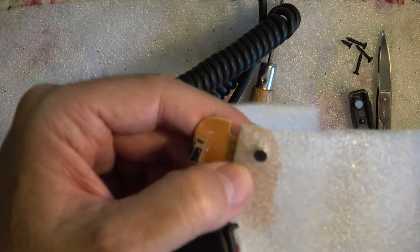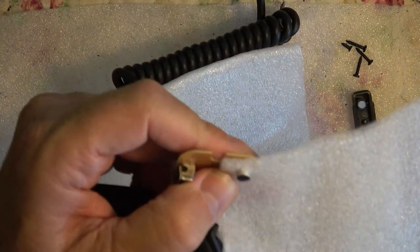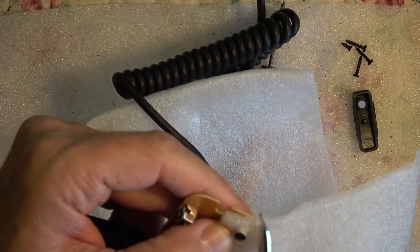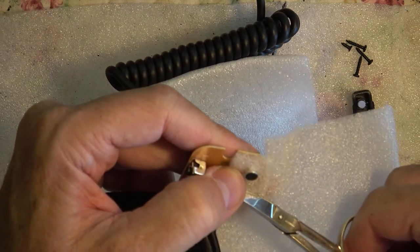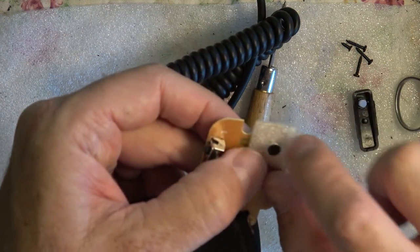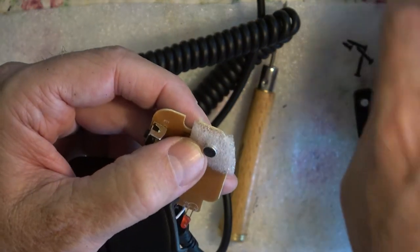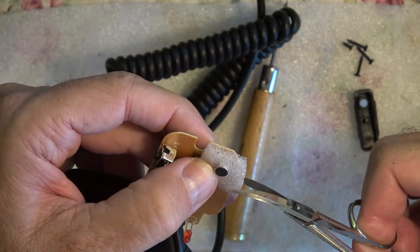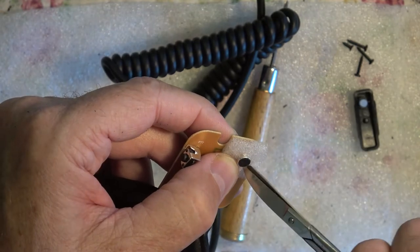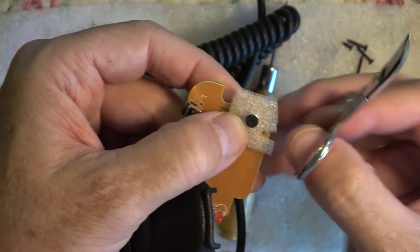What we've now got is a piece of foam on the other side of the circuit board with a little bit of overlap on the edges here. Now I'm going to take my small scissors and trim on the outside edge — not right against the circuit board but leaving a little bit on the outside, about an eighth of an inch or so. Then we're going to cut in and finish off by leaving a little square. So we've got a small square of foam here. We have the place where it mounts here — notice that there's not going to be any interference of the foam at that point. Over here is where the screw goes, so we're going to cut a little nibble where the screw is supposed to go, but do not cut so close to the microphone as you will damage the seal you're creating. Now the screw will be able to go in through there without compressing the foam. We don't want the foam compressed anywhere.